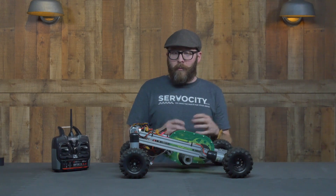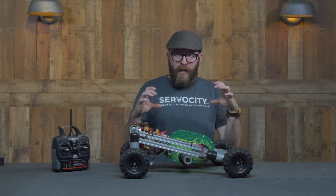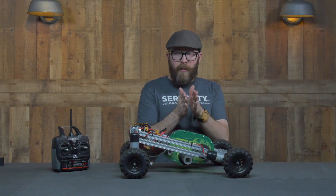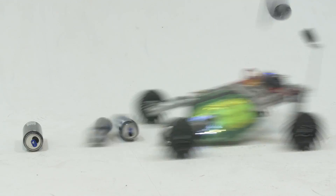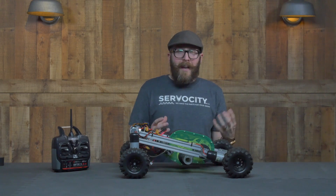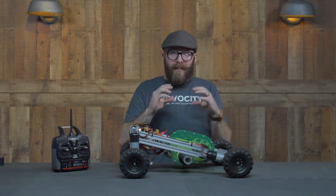If the rollers are too close, they won't grab onto the can enough to pull it through. If I had larger washers or bigger drums, I could get them closer together because by the time they contour out to where they grab the can, the closest point could be tighter overall. Given the washers I wanted to work with, this is about as close as I could get and still very consistently grab cans, pull them up, and crush them. The fun thing is you can hit a can several times and each time you just crumple it even more — the goal was something fun, violent, and theatrical, not a precise flat pancake.